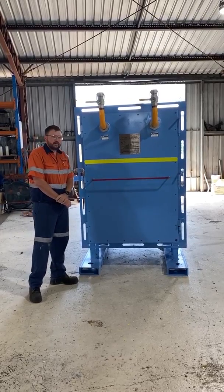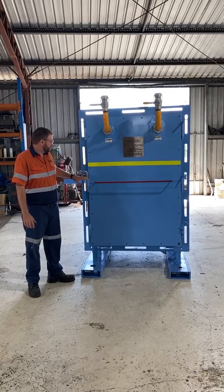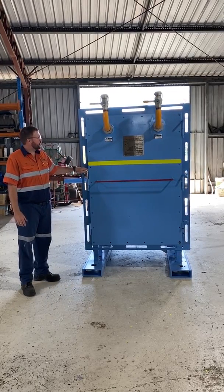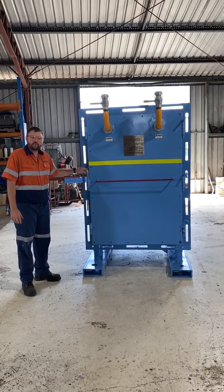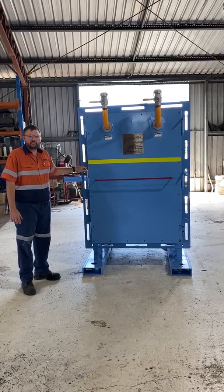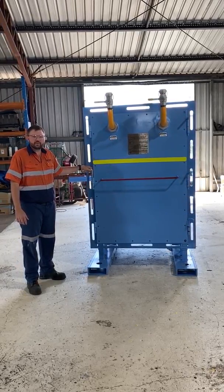On both the goaf and fresh air side of the door, they are both double hinged. When this arrives on site, there will be 6 pins in the front door. To simply hinge it either way, we'll pull out the hinge pins at the side that we will not be using and allow it to hinge in the direction.